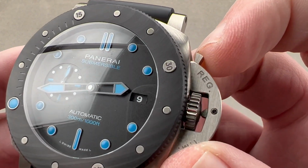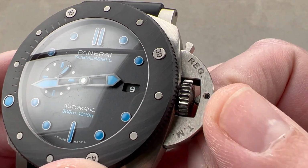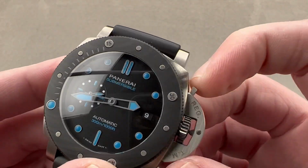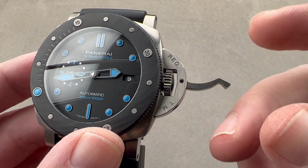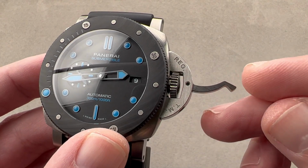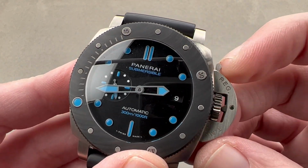And one big refinement compared to the earlier Panerai watches, and I think the break point was 2007 for this feature, you can see there's a little bearing in the cam lobe itself that's called the runner that smooths out the action. The other thing is it prevents you from accidentally drowning your watches. This is kind of hard to miss, whereas a screw-down crown that's out a few threads can often be overlooked even by a careful owner, leading to involuntary drowning of your watch.